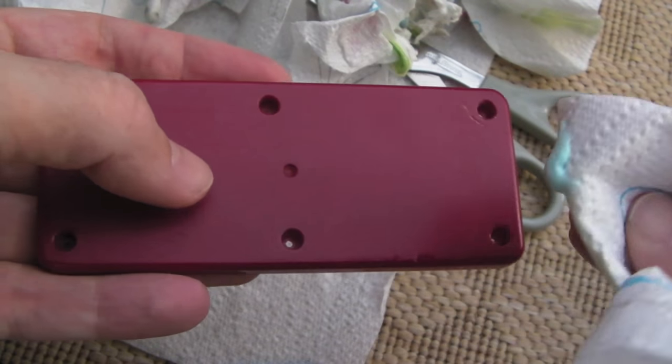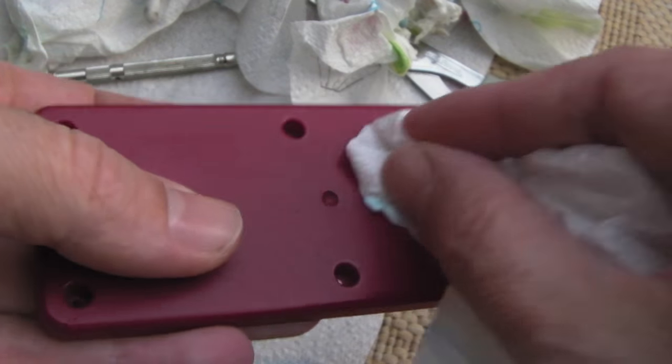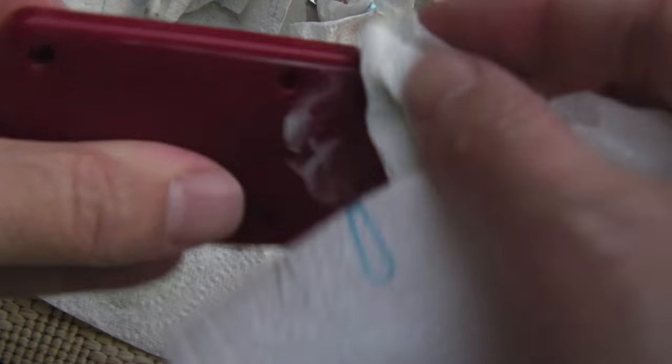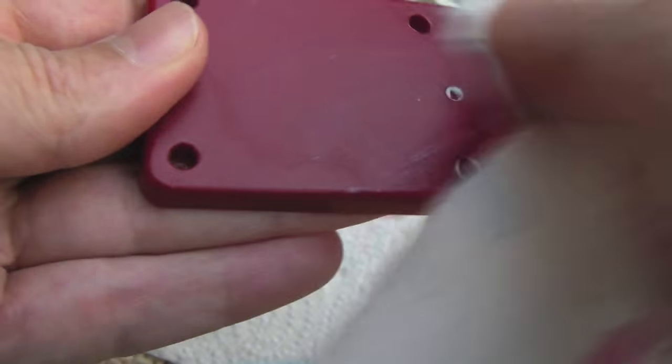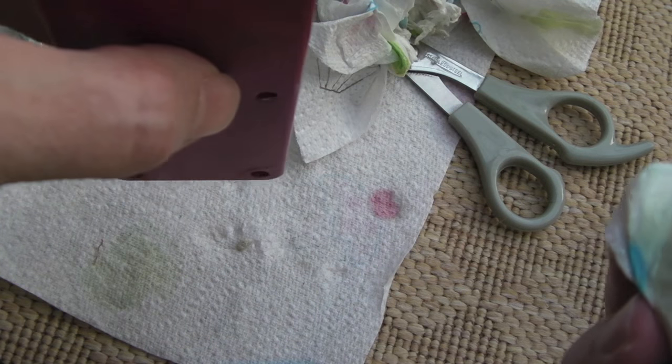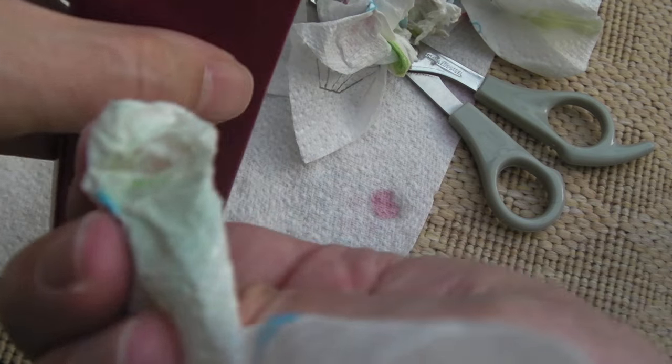Even when you wash these in the sink and think you've got all the dirt off, as soon as you get plastic cleaner on here and go over the edges, the colour comes up really well, and you can see it goes slightly dark — it picks up dirt that's actually ingrained into the plastic. But it brings back the colour and gets off any bits of dirt. And for the composite mod, you need to remove all these components — you can see these nice clean pads. Then I've got a 220 microfarad cap: positive goes from here, negative goes across to there. And then just a resistor — I'll show you that in a minute. You need to remove the 2K2 and put a 200 ohm resistor there, remove the 220 ohm resistor from here, and put a wire link across there.